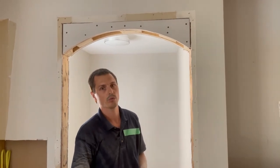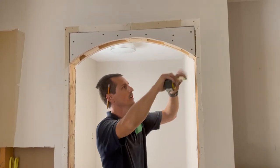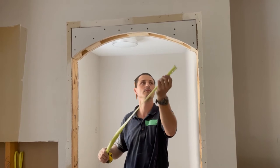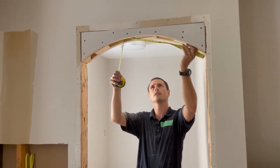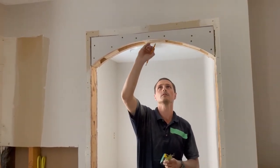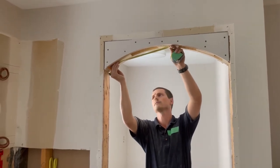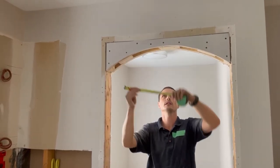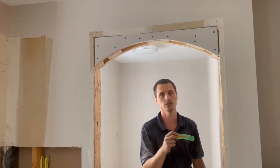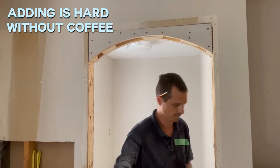Next, you're gonna wanna measure the overall width. So I've got 4.5. I'll cut my drywall at 4.25. Try and get a rough measurement of how long it's going to be. Easier said than done. I got 16 to here. And then 18.5 to there. So 16, 32, 34, 35.5. So I would probably just do 35, it's probably a lot. So I'll cut that.